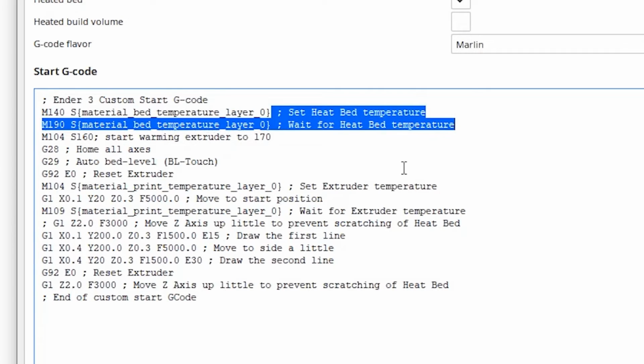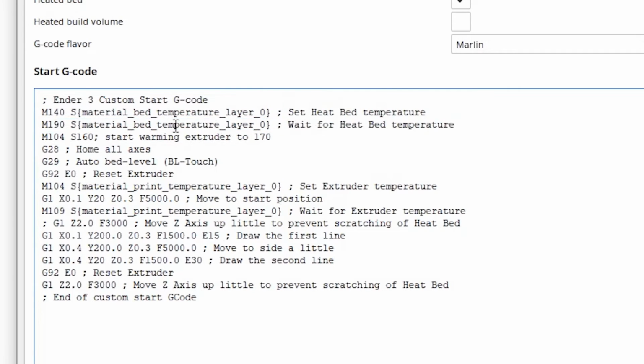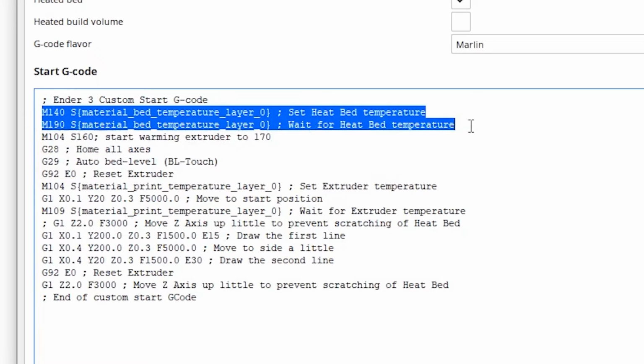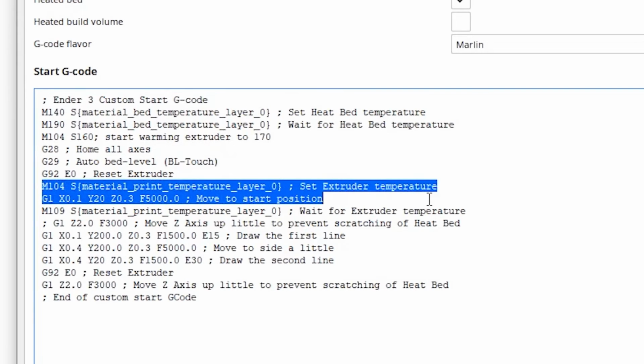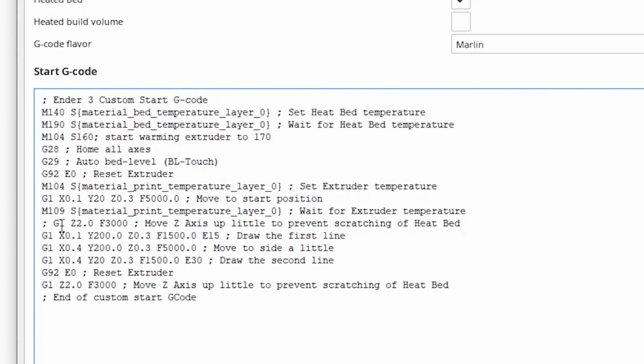This can actually cause problems with the measurements of the 3D Touch, because the 3D Touch is trying to measure when it feels resistance coming down to the bed, and if you have a bunch of runoff on the nozzle, that could interfere with that. Plus, it's also messy. So I have it heat up to a standby temperature, which is right below the melting point for the PLA, and then I'll do the homing and the auto bed leveling, then I'll raise the temperature to the correct temperature before proceeding to the rest of the script. I'll attach this in the description below.